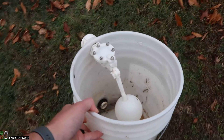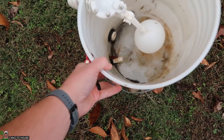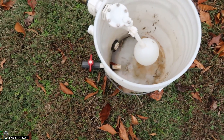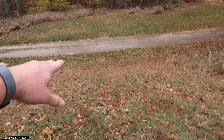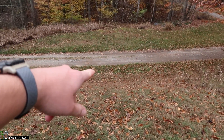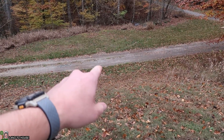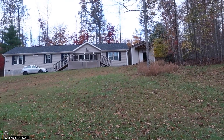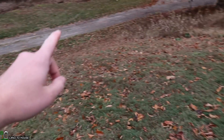I'm going to use this five-gallon bucket with a float valve as the source — normally you would use a creek or small river. I'll have a half-inch drive pipe going down this hill; it's a little over seven feet of drop down to the road. So let's say this is the only place your screened intake could go and that's the only place the ram pump could go, but you're only wanting to lift to the porch up here.